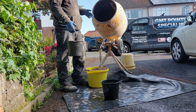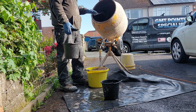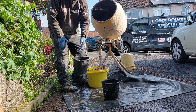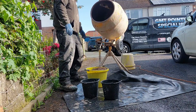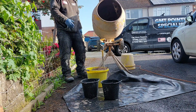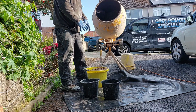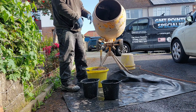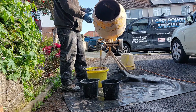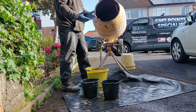Right, so that's like a bricklayer soup, I call it. It's not going to splatter anymore, it's not thumping because it's too wet. So what I'll do now is add, because that's really wet, you can't point with it, the dry, already lime mix. You can put that in and it'll dry it out into a pointer's mix.